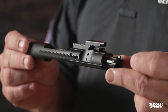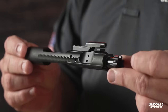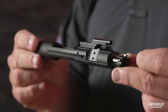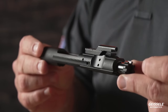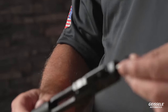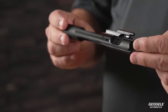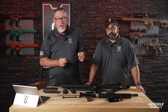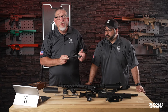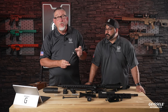They call it DSL, durable solid lubricant. And we have modified and changed it into the ultimate firearm coating. However, it's expensive to put on. There's a lot of handwork that needs to be done to any part that gets it coated. And so what this is, is military spec MagFos. The carrier is military spec 8620 steel. The cam pin is mil spec 4140 chrome moly steel. The gas key is 4130 mil spec chrome moly steel. And the bolt is Carpenter 158.